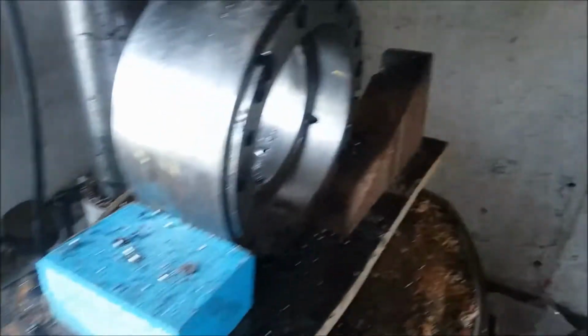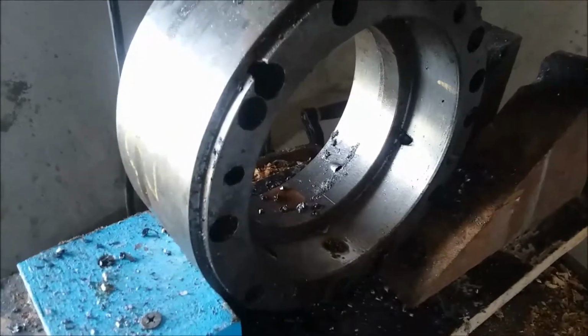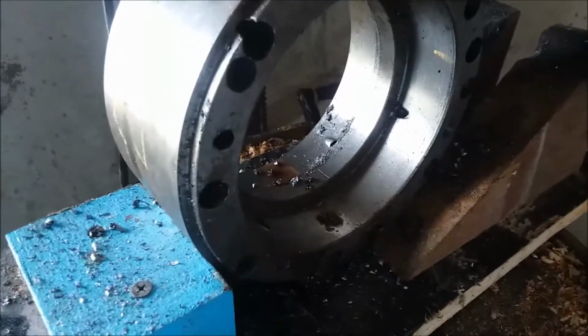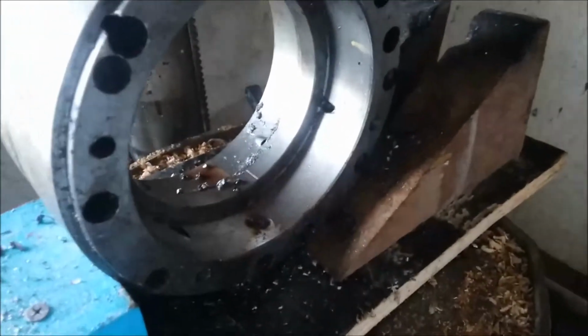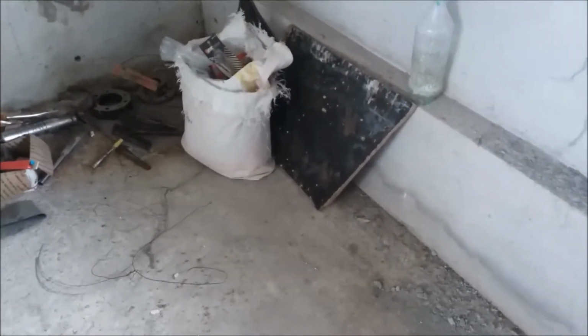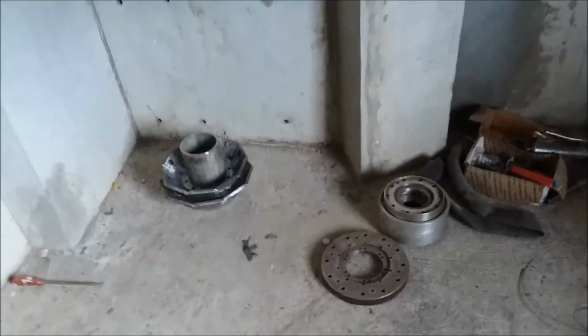If I hadn't interrupted him, he would have finished this. These holes that look like they're only half in it are supposed to be that way. That's so that you can use a set screw on the other side and push a bearing race out. There are 2 races that go in that. There's a spherical 22216L and 250, 272, 580 and a 272 cup and race Timken. The Timken balances the Timken that goes in. I don't know where his housing is. That piece there goes between them. It's part number 6, but I don't know where it is.